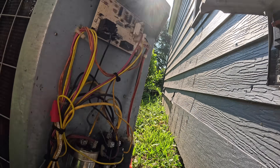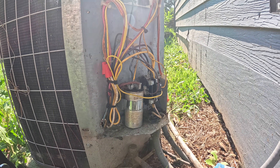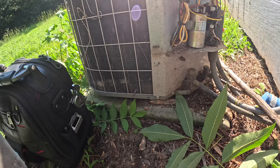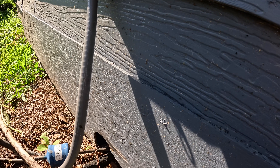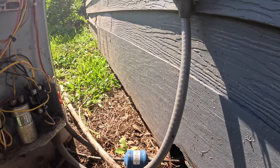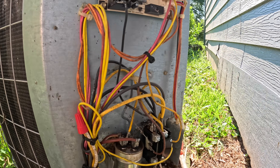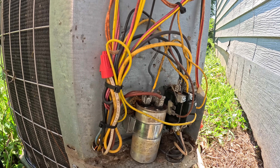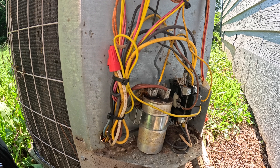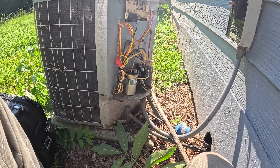I think I have replaced this capacitor — it's been a long time though — and I have treated this whole area for ants at least once before. I went and bought some ant killer and treated the whole area, but they have a bad infestation. They're all over the place and they can get in that contactor. Right now I need to check that capacitor, see what it's supposed to be and see what it reads.